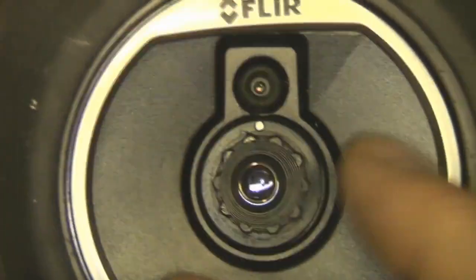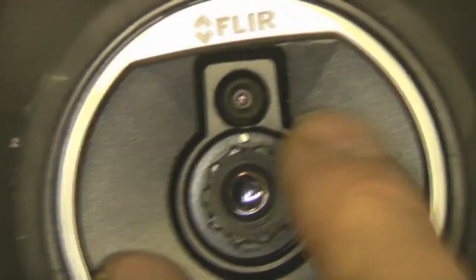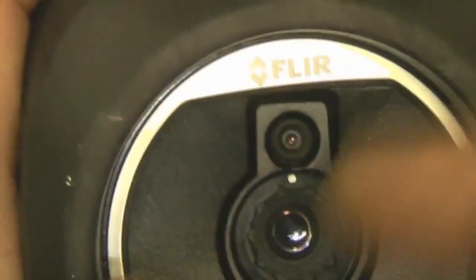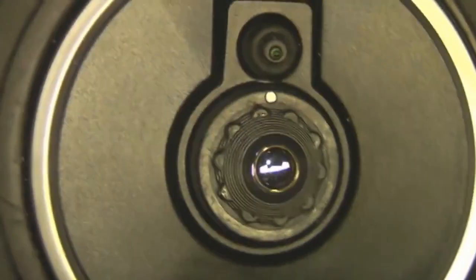The other approach is to actually adjust the lens itself. This lens is fairly easily adjustable — it screws into a thread in the main body, as you've seen in the teardown video. It's supported by a rubber block that sits in front, which is part of the shock protection. That block provides just enough pressure on the side of the lens to keep it where it's put, but it's not so tight that you can't turn it. The problem is actually getting to it to turn it, because all you've got are these inward-facing semi-circular cavities, and unless something's quite rigid it's just going to cam out.